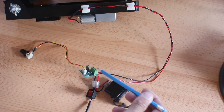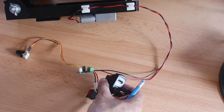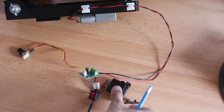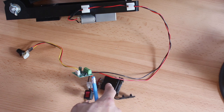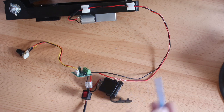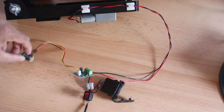So I've measured the output voltage. The voltage goes to the motor, it's 10.3 volts, and what I was hoping was that this will be sensitive enough to measure the chopped voltage that's going out to the motor, but it's not. It's for a car battery, so I presume it's quite good at averaging or measuring the peak. So I'm going to use that one to measure the health of the battery or the power supply, and then I'm waiting for a voltmeter, fingers crossed, that will actually give me that sensitivity to measure the output voltage that goes to the motor. And then all I have to do, if it's cold, or the battery's getting flat, is twiddle the twiddly knob, and then I know I'm getting my 10.3 volts to drive the motor at 1 RPM.